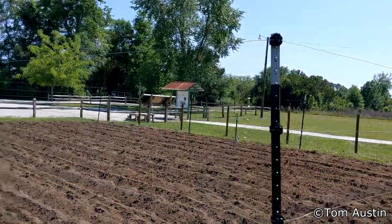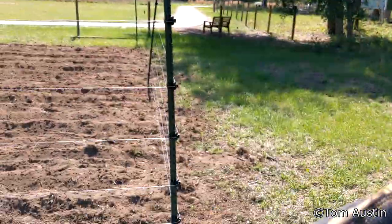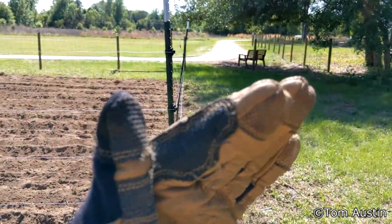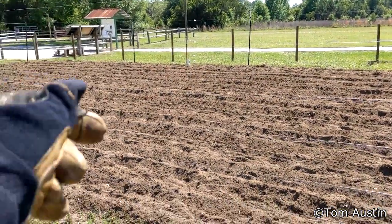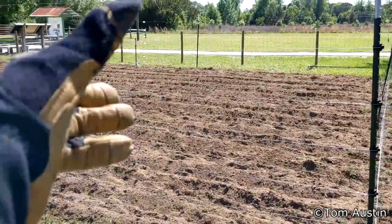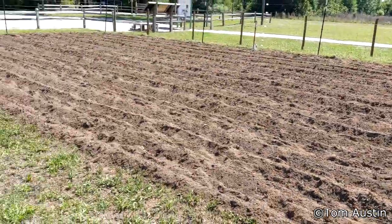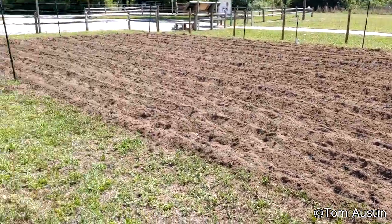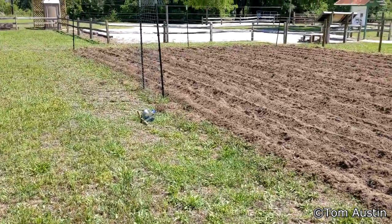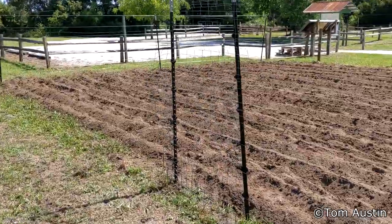I drive them to about 6 foot. You drive them in at maybe a 10 degree angle like that. This guy was like this, and then I have those tensioners over there that you put on the wire when you string it, and you just tension them down, and then it pulls the corner posts in and pulls it nice and taut. Deer stay out of it. If you set it up correctly on the front end, you can electrify it if you want to, but I don't fool with that because I don't really care that much.